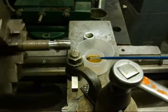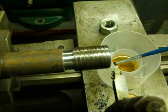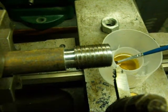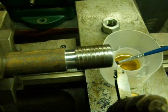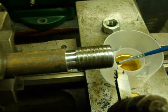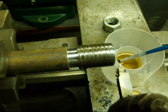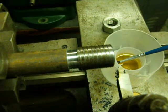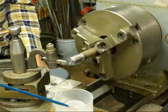The thread is starting to form now. You can see we've taken probably six or eight passes and you can at least see where the thread is. I cleaned the oil and chips off. I'm running it at a slightly faster speed now, but you may want to continue at the slower speed. I'm going to set the camera up on the backside and take a few more passes to see if that shows up any better.